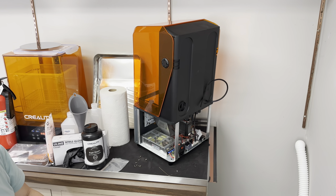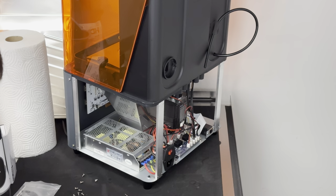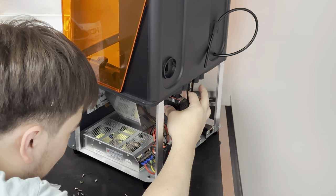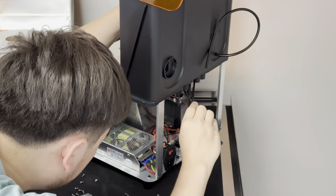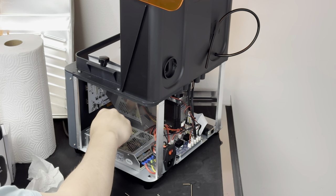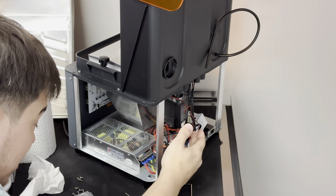This is a good opportunity to take a look inside a resin printer. We've got a power supply and a big stepper motor — and it looks like this stepper motor actually has an encoder built onto the back, so it's got closed-loop stepper control. There's a small control board and a light cover to prevent ultraviolet light from leaking out, and right up against the top surface you've got an LCD screen. It's really simple and basic down here. The problem is the coupler — rotating it turns the stepper motor but not the lead screw.